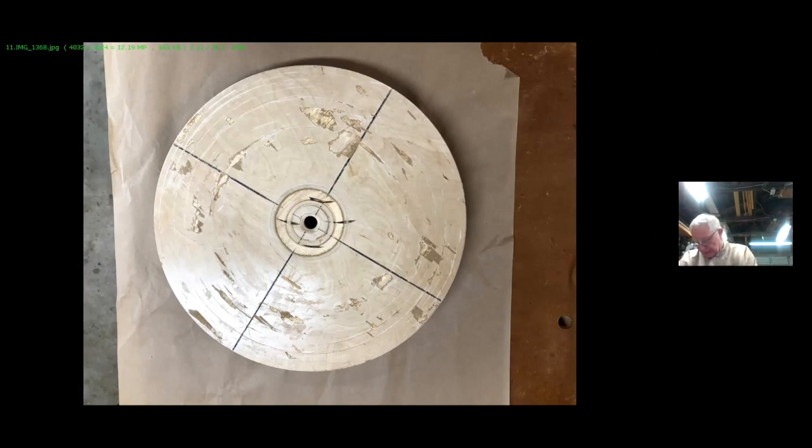I just use hot glue and I don't know if I'm pushing the envelope with it a lot, but I use 4 pieces about 1 inch long. So in 4 places equidistant around the circumference of the ring, I just put about 1 inch of hot glue on there and then use a wood chisel and a mallet to pop it off when I'm done. And it works fine. As I say, it doesn't look real pretty, but it sure works.